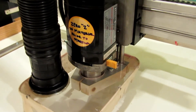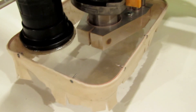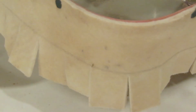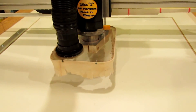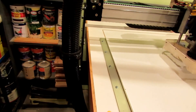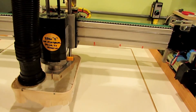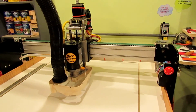In the meantime, while I was waiting, I made a clear plastic dust guard to go around the router motor on the bottom. I just kind of wrapped it with some old filter bag from a dust collector. Then I got a long shop vac hose that just kind of goes around and winds back to a shop vac. I was going to hook it to my dust collector, but it turns out it does not get enough velocity to do a good job, so I have to use the shop vac right now.